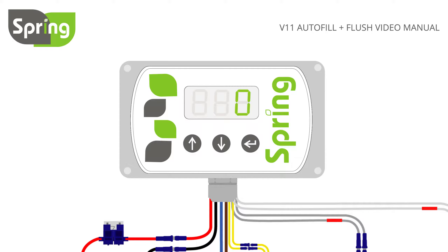To select the required filling mode, press and hold both the down and enter buttons. The controller will display the fill on demand menu, or FOD. Press the up or down button to change between on and off. Off will set the controller to one time fill; on will set the controller to fill on demand.